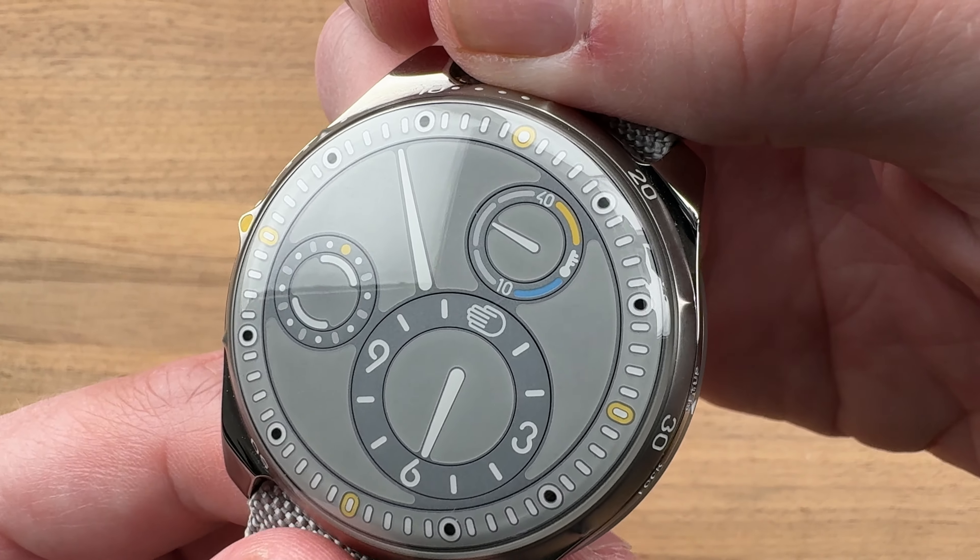When I move the display, you can see it is in fact a regulator, but also a planetary — a system that is quite easy to use and approachable. You use the case back to wind and set the watch. It's unique in that it has no crown. You can use the friction zones on the back to wind it, although it is automatic winding with a visible rotor from the back. You can lock it once it is set, and fine adjustments are still possible when locked, but they require a deliberate focused effort as opposed to casually moving fore and aft when the system is unlocked for setup.